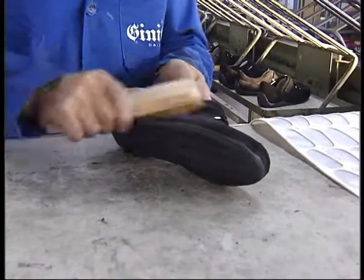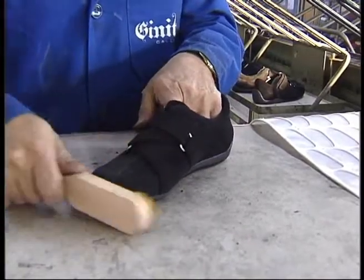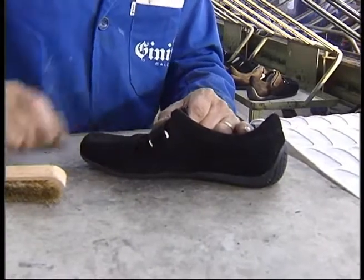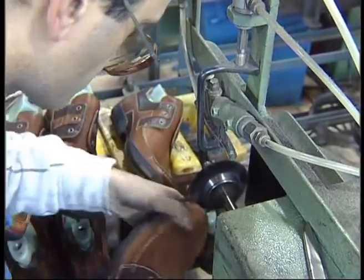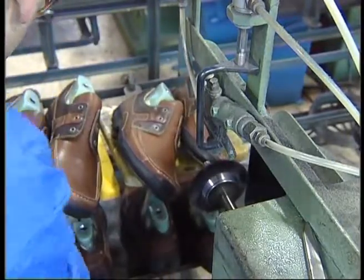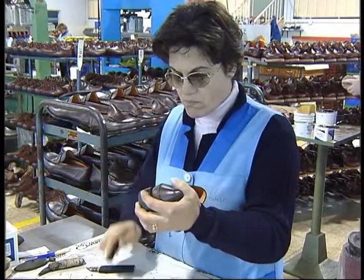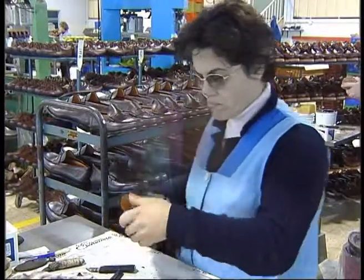To clean the shoe: we proceed to the verification and cleaning of the shoe, which consists of removing the glue residues found in the junction area of the sole to the upper and inside the upper. Several tools, equipment, and products can be used. To remove glue from the assembly board, the glue cleaning machine can be used. For materials where this is not applicable, we use the eraser crepe, wood spatula, water sandpaper, or a final cloth soaked in the appropriate cleaning liquid.